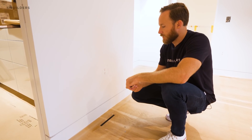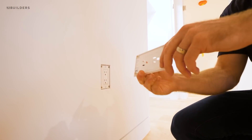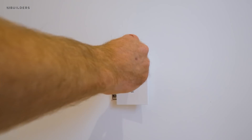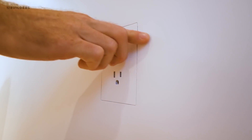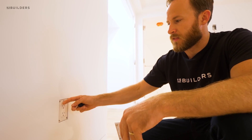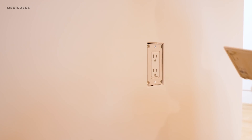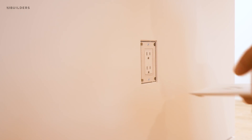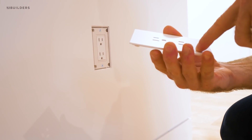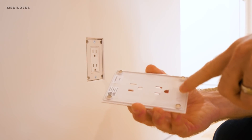What we're looking at here is a standard Decora outlet. I have this little tool — basically a mini plunger — and if I put it right on top I can pull that plate off. So this is the standard Decora outlet; the plate comes with it along with the box, and there are four screws that allow you to micro-adjust the device in and out for the final product. It doesn't change where the mud flange is — it simply changes how the device relates to that mud flange. We painted these the same color as the wall while we were painting, laid them on the table, and there are four small magnets on the back.